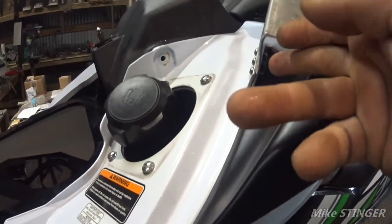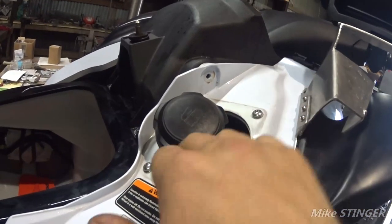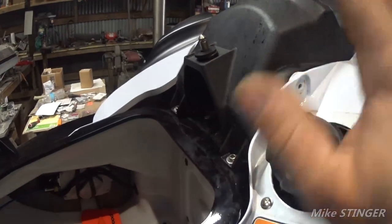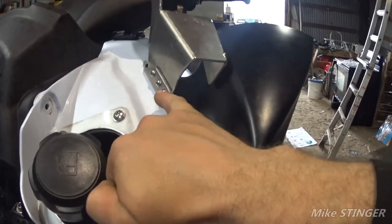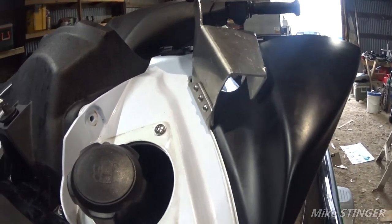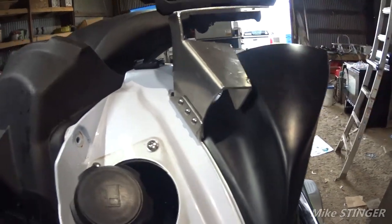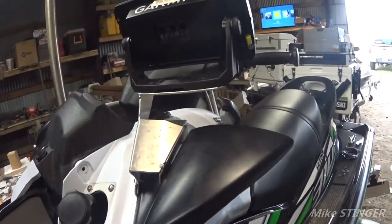They're going to go under the lid through here. They're gonna come in here. There's a rubber piece that covers this hole. And then from there, it's gonna go inside in there, run through. And I saw on that other side there is a rubber fitting in there for the cables, so we're going to feed the wire in there. But let's talk about the mount. As you can see, I attached the mount here on one side with the three screws. They're 10/32 by half inch with the Allen head, so they're on there pretty nice and snug. Only thing is now to join these two and make a cover. So let's get back to it, and I'll keep you up to date on what it comes up looking like. All right?